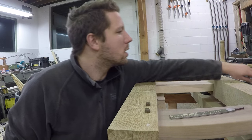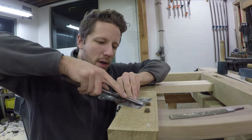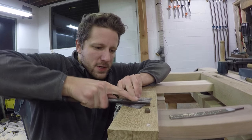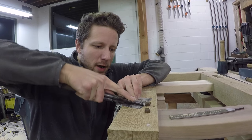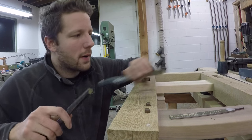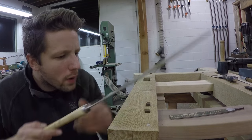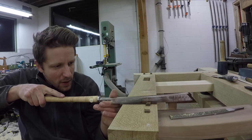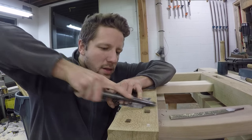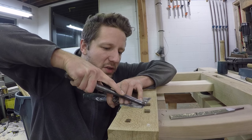Some methods show that you can use a chisel and like a putty knife — you use the putty knife so that your chisel doesn't mark the wood, and you kind of use your chisel like a fulcrum and pry off the wood. Now this works, but I find it's not quite as accurate as cutting your pegs to height first. I find it's hard to get a smooth face; it kind of goes up and down and gets almost a scallop.